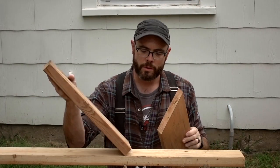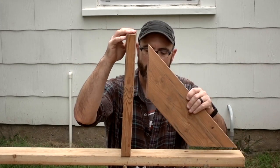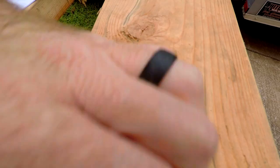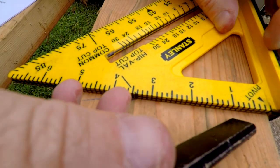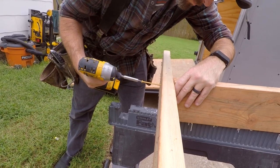This piece is really the only important structural piece — you're gonna be putting a lot of force on it every time you rock backwards, so this little brace is actually what's keeping everything together. Now I'm going to mount the backer 18 inches from the back edge of the base plate. Take a speed square and draw a line across the plate, and when we mount the back we'll make sure it's on this line so we know it's square. Screw that in from the bottom.